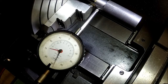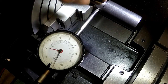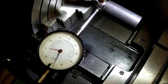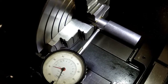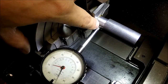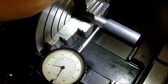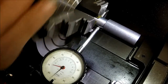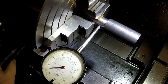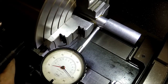Alright, so I got it flipped around, getting ready to drill it, and I decided to put it in the four-jaw just so I could true it up off of this surface because I can't hold it here. Turn you up so you can see. I can't hold it here, the part that was machined to match the bore, so I figure this is the next best thing here. I'm pretty far out right now, so